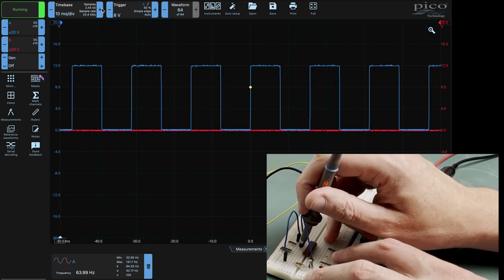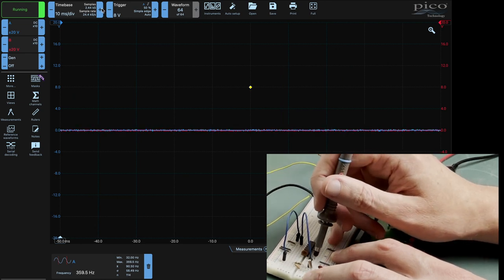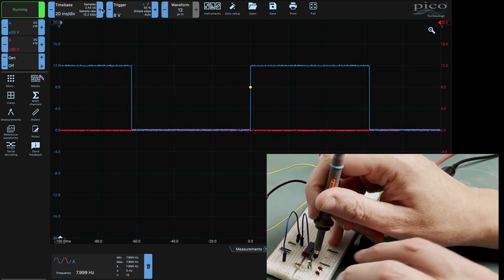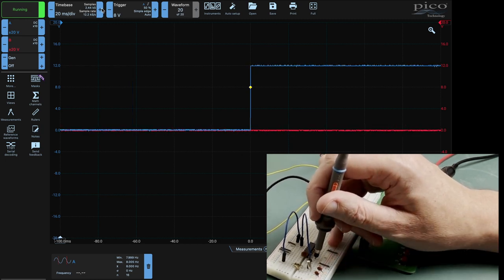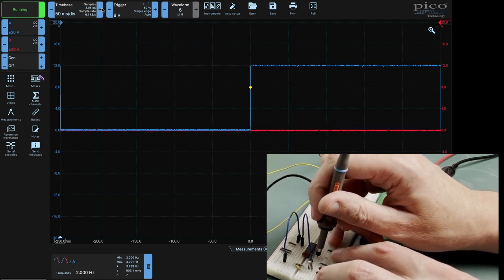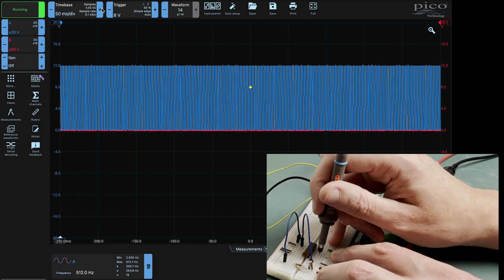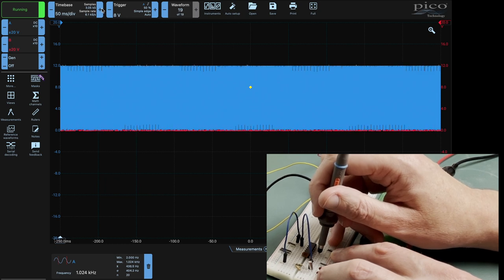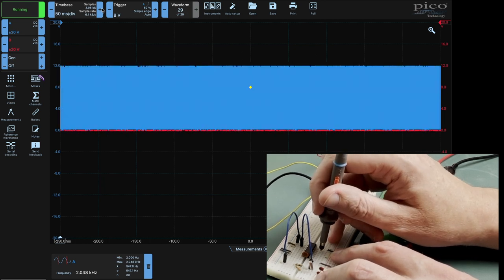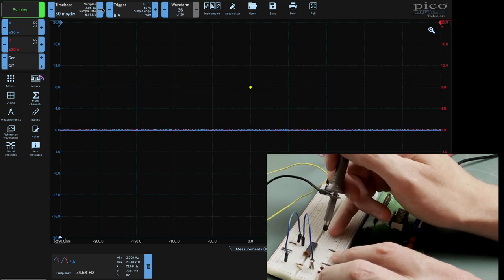The next one should be 64 hertz. And then round the other side - there's our 8. There's a 4. There's a 2. There's a 512. 1024. 256. And finally the 2048. Obviously these pins aren't in the right order because of the way the chip's laid out, but you can see we've got all the signals there that we wanted.